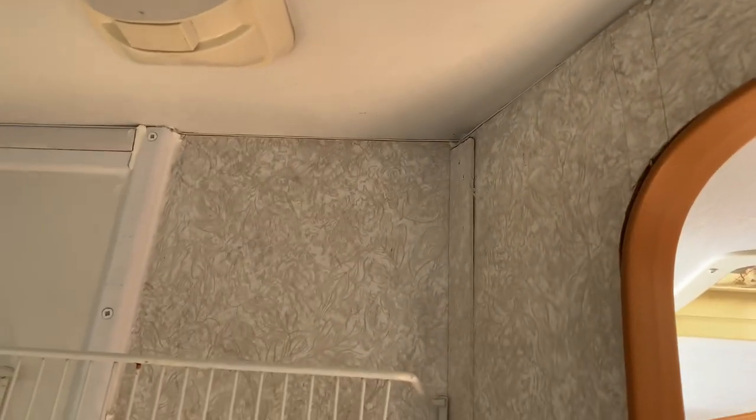After I'm done painting and all that, I'll go through and reseal everything on the inside. On these countertops, I decided I'm not going to rip them out at this point — I'm just going to refinish them using the Rust-Oleum countertop refinishing paint. It's an epoxy paint, so you just rough up the Formica, roll it on, and it kind of self-levels.